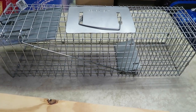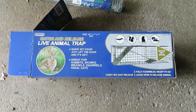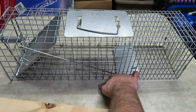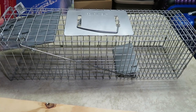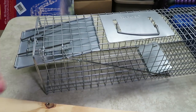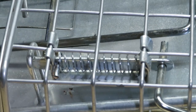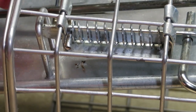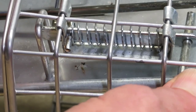In this video I'm going to make an interesting conversion of this purely mechanical trap, which works well, but I want a trap that will be able to contain a number of different size animals, all the way from mouse up to maybe a squirrel or a cat. To do that I need to make this operate by a sensor. I'm going to use a PIR sensor to pick up heat and motion, then transfer a signal to a solenoid that will operate this lever instead of the existing mechanical interface. So I'm going to take out a couple of mechanical parts and put in some electrical parts.